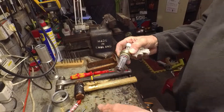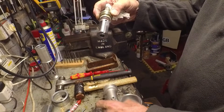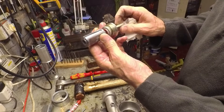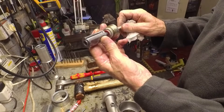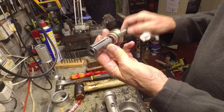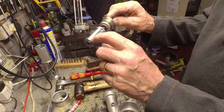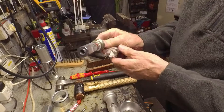So that's obviously fixed to the jack itself. As this rotates, it can push this element forwards. That thing I've drilled out is just a pin to locate it and stop it rotating — just this milled groove to keep this thing oriented properly.